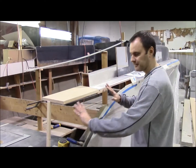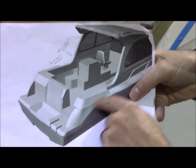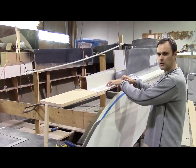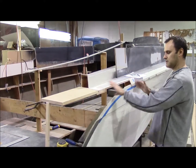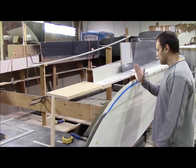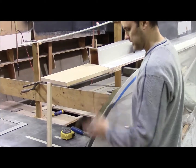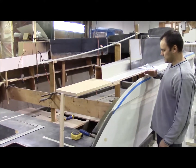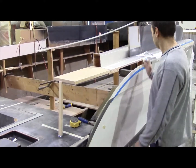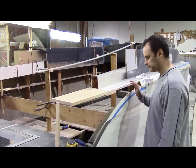That's what we're working on now. We are creating the side section — I'll show you the drawing here. So just this area in here. We've cut back our old deck that we started with and chopped out this section of the deck where it joins the hull. So from there it's going to change. If you were to take a straight edge, it'll be straight anywhere vertically along here, but the angle changes as we go aft. So this is going to be about 6 degrees here, and this is more like 30 degrees from vertical. So it's going to have a twist in it.